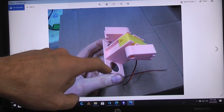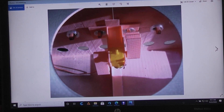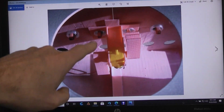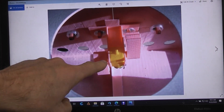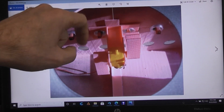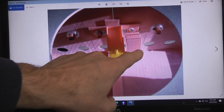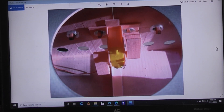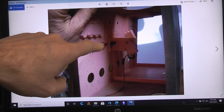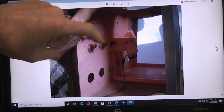These large holes provide alignment. We're looking through the very top of the head where the gyro section would be — looking down through the gyro hole. You can see one of those holes on the motor mount, and there's the other one. Here's the top of the front support that's glued in the front of your mainframe, so this just glues onto that to keep everything aligned. You've got these shoved on — glue that in position. Here it is from the side, so you can see how the sax valves hang through, and as this turns around it's going to catch those and lift them up.